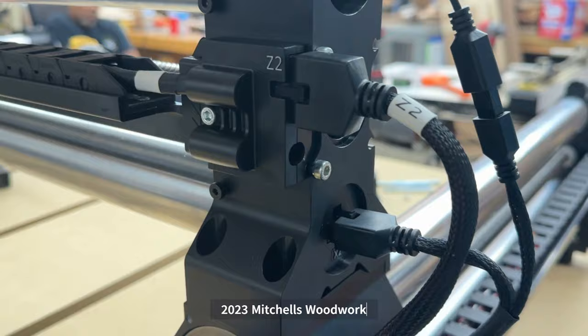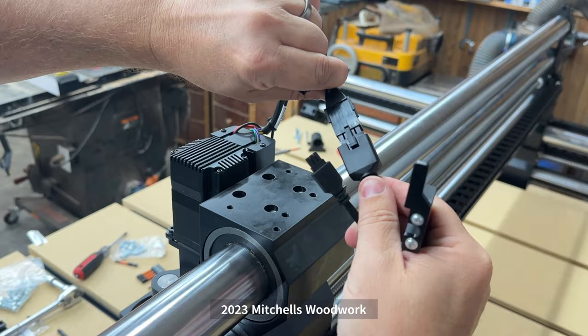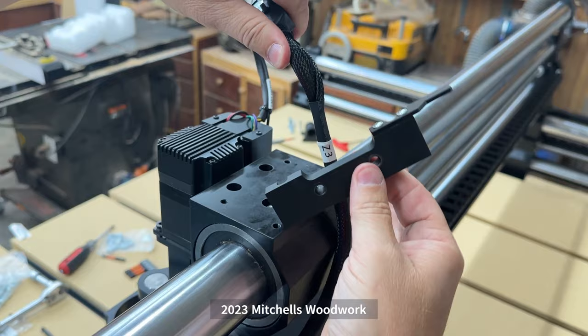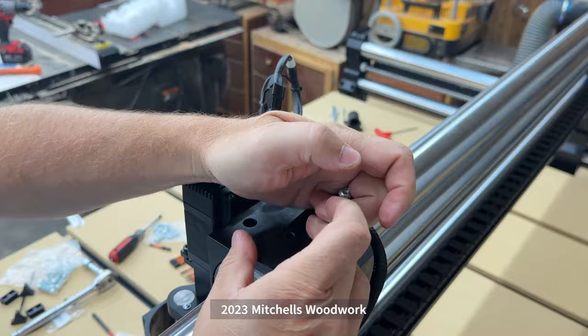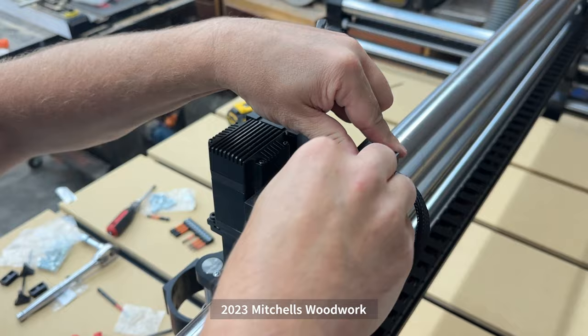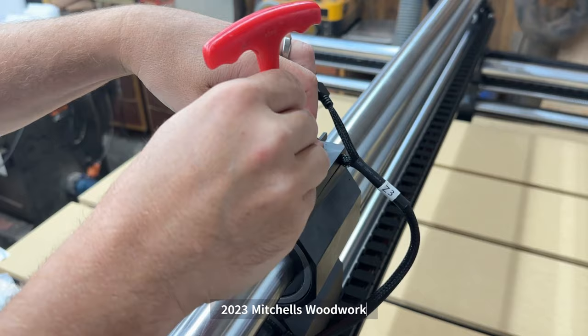Okay. All right, we're at the Z. We're going to plug the Z3 into Z3. It's the 8-pin connector there, 3-pin connector here. And then we use this top plate to go in through here onto the top. Tight fit. And then these bolts will hold it down onto the stiffy. All right, once we got that in there, we get those bolts there. Now we don't have our spindle or router installed, so we're gonna take this plate back off to run that when we do it later.